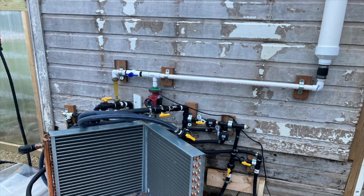Although the design of the high tunnel system seemed sound, implementation problems resulting from mistakes in judgment and a natural disaster soon became apparent and altered the project goals. These problems are described in the report. Fortunately, the connection between the high tunnel and corn drying systems was done during installation. In the project's second year, the inner high tunnel loop, which remained functional, was connected to one of the two heat exchangers, and the dryer loop was connected to the other. The two systems operated independently but in concert to heat the high tunnel using a commonly shared fan. Although the misfortunes resulted in the abandonment of part of the project goal, the connection of the two systems still provided an opportunity to test geothermal heating.